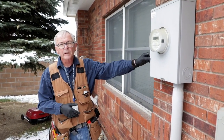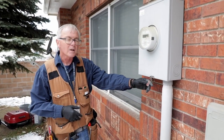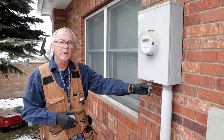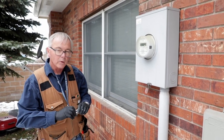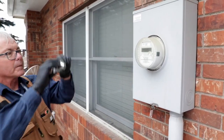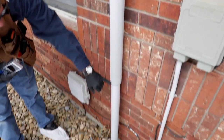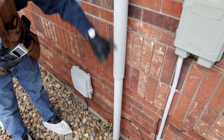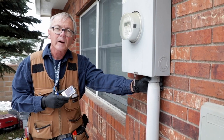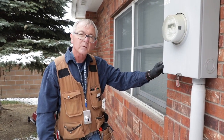Here we are at the main service meter, and there's not a lot we can look at inside. It has a meter seal on it and the power company does not like these removed — they're sealed for safety to prevent unauthorized modification. We can check that it's secure to the wall and take a reference photo. We also check our riser; this has an expandable type riser which accommodates any soil movement so we don't pull any part of the conduit riser out of the can. Everything looks pretty clean here. We're now going to move inside and start testing some receptacles, switches, and lights.